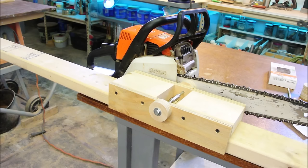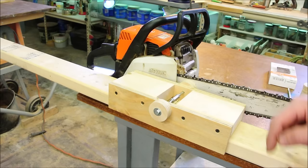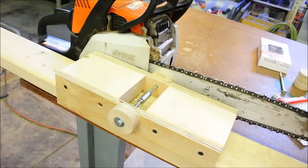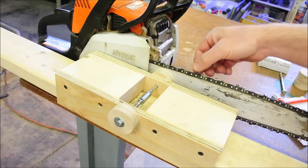I haven't tested this, but I feel certain I can produce a usable result. Why am I confident? Because I can do it without any jigs — with some practice you can freehand well enough to run your board through the planer and get away with it. I'll be using an MS-170. It's really lightweight, really cheap, makes a thin cut, and I have the chain extra sharp so it should rip right through really quickly.